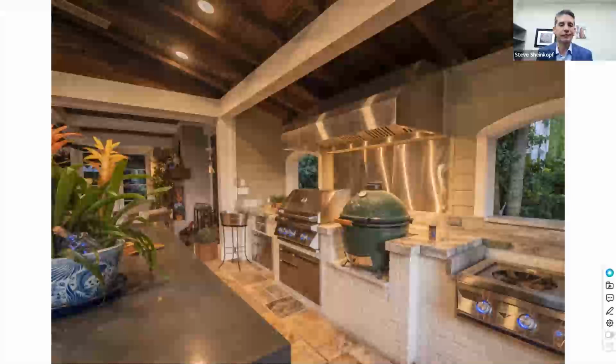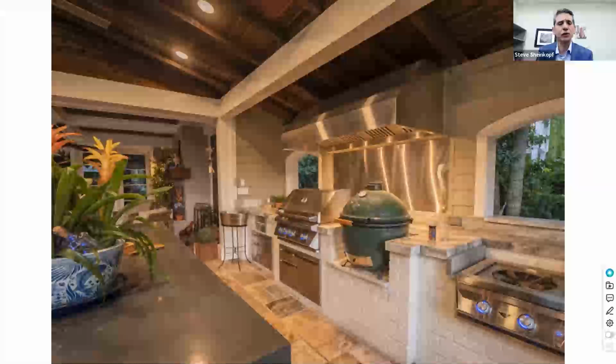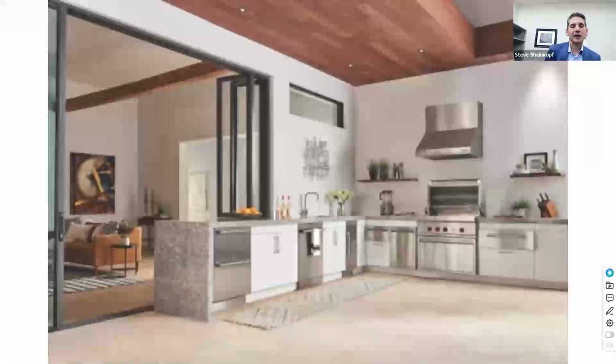This one is, they did everything right, except, and most people would know that the outside burner on the right-hand side, that's 70,000 BTUs. That's more than most 30-inch ranges sold, which are under 70,000. So you really want to vent that, or make sure the wind is blowing it out, okay? Because you don't want that in your house. You don't want 70,000 BTUs of smoke, grease, and toxic fumes. You don't want to design it in somebody's house. So just be careful.